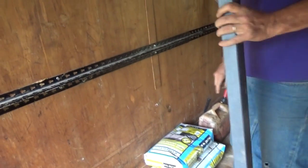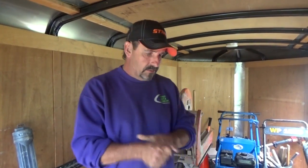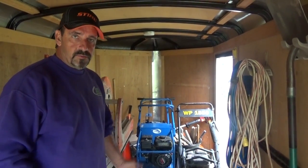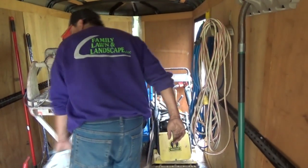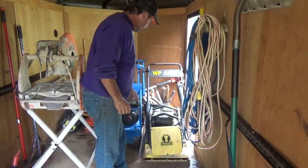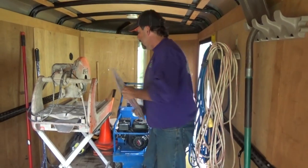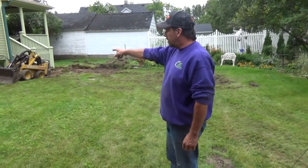Here is our polymeric paver sand that we're going to use on this project, and that fills in between the joints of your pavers, and then you water it several times, it turns it into a kind of like a hard mortar, but not like concrete, but it does get relatively hard. Sod cutter we use for cutting up a little of that sod. We realized it was so wet in here that it was just ripping. So we thought, well, we might as well just come in with the mini skid steer and the big skid steer and take care of it. Here's our compactor, more joint sand. Compactor, we use that for everything. We always bring another saw blade with us, so in case this thing gets dull in the middle of a job, you have a backup. Now we're gonna use the mini skid steer to cut out that walkway, and I'll use the big skid steer and cut out our big paver patio over there. So let's get to it.